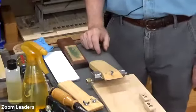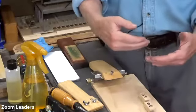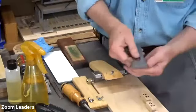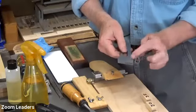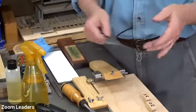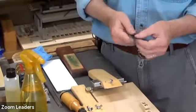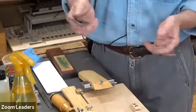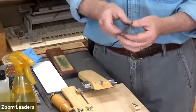So you recommend the micro bevel instead of just doing the whole primary bevel? It's much less work. Yes, absolutely. Until you can't. You proceed with a micro bevel and it gets bigger and bigger as it moves back the edge of the chisel, and then eventually you have to redo it. But as I said, it took me 45 minutes to clean up this bevel, which had been rounded over. And then putting that micro bevel on took, as you saw, 10, 20 strokes or something. So when it gets dull, I'll do that again for seconds, then a minute, and then eventually I'll have to go back and redo the bevel, but it's much faster.